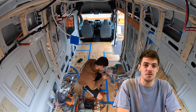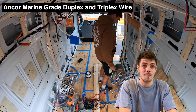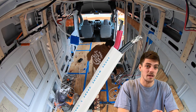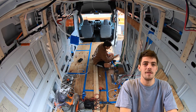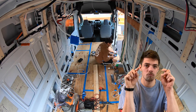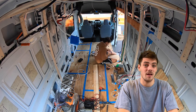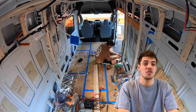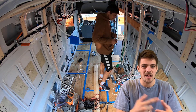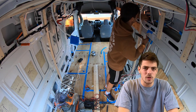All you need to know about what's happening right now is we are running wires, making wire runs. I use mainly two types of wires: 12 and 14 gauge Ancor marine grade duplex and triplex wire. Those fancy words pretty much mean that you have the negative and the positive running together, which keeps everything organized. There were a few other different gauge wires for other components — I'll have those in the description. Biggest tip I have for wire runs is SOP: Slack, Organization, Protection. Give yourself enough slack, keep everything organized and labeled, and protect your wires.